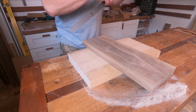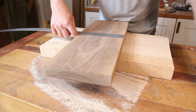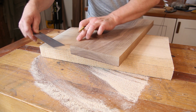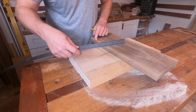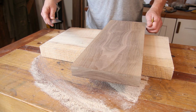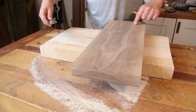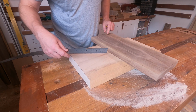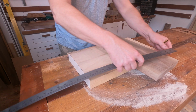So what I'm going to do is, this is about 7.5 inches wide, and I want 7. So I'm going to cut this side off, which is the side with the thinner bit of lighter coloured wood. Now that might sound like the opposite of what I want, but you have to bear in mind the overwhelming majority of this side is going to get cut off with the shape of the guitar. So we will lose virtually all of that anyway, so that won't be an issue.